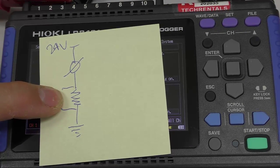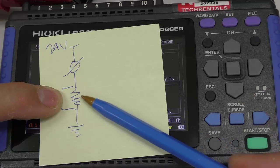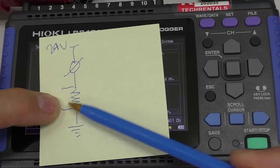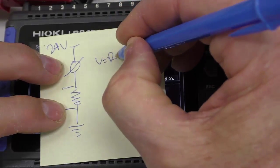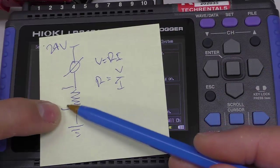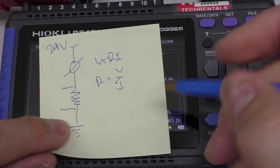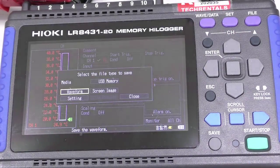If you're wiring this up to an existing system, you've got two choices. If you can figure out the value of the resistor in the control system you're using — you can work that out by using documentation or a little bit of maths — use a multimeter, measure the voltage drop, and use V = RI, so resistance equals V over I. You know the current and you can work it out. The other choice would be to break the loop and add in the measurement system in a wiring that looks somewhat like this.